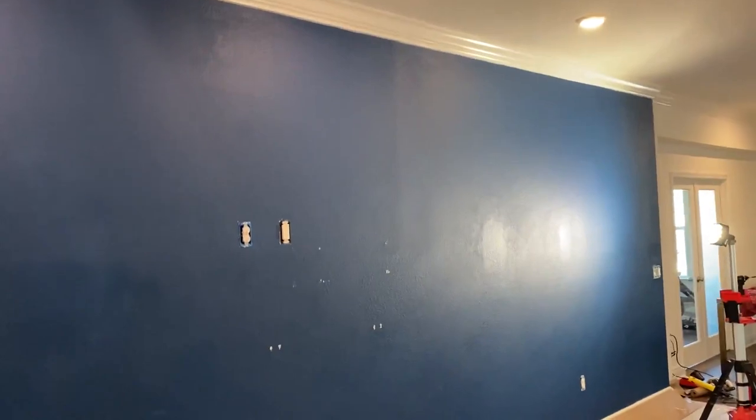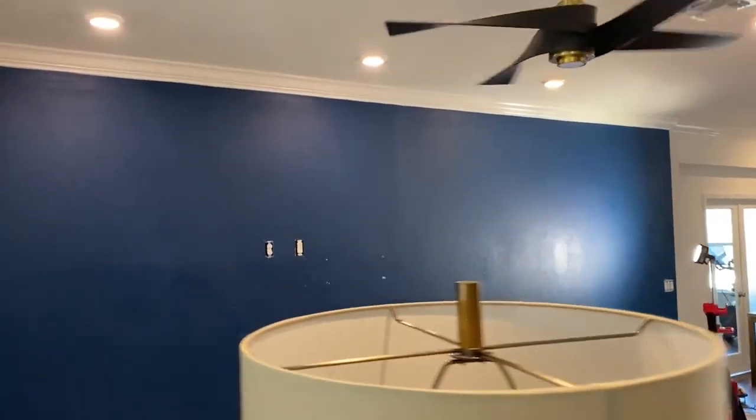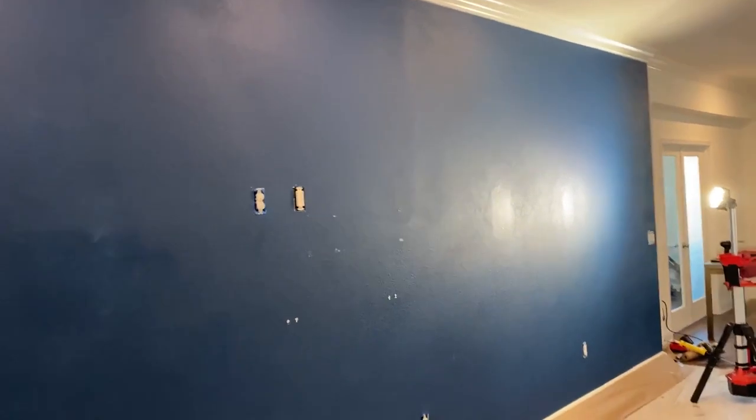So look at this ugly wall. Now please know, it's not painted yet. I didn't do this. See all of the little swatches where the customer painted it with a brush? Very, very dangerous to do that. You may actually build up your area there, and it'll never go away until you retexture the entire wall. So please don't do that if that's you.